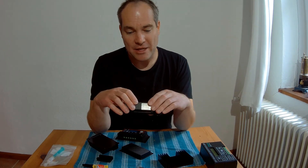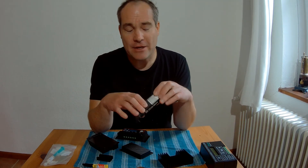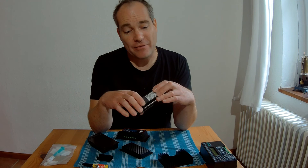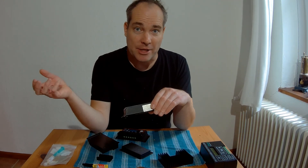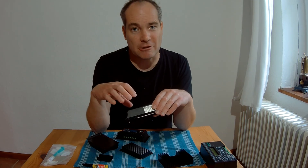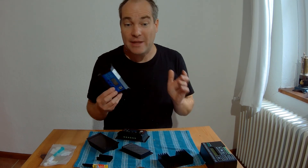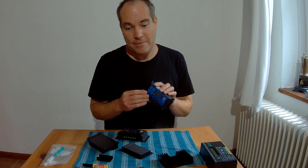Just a final word on PWM: it's by far not as efficient as MPPT, and I'll explain why in one of the next videos. But PWM can actually be better in some cases — especially if you have solar panels for a radio station or emergency communication, for example on a sailboat where you need radio communication or weather information reception. MPPT controllers produce a lot of RF noise, whereas PWM doesn't. So there is in some cases a real advantage on the side of PWM controllers.